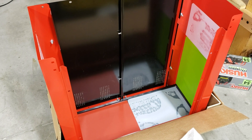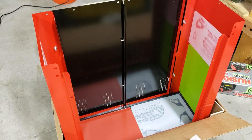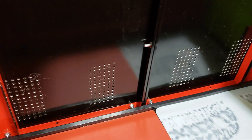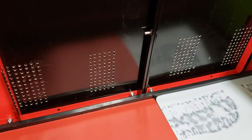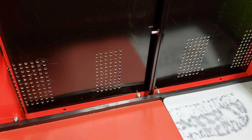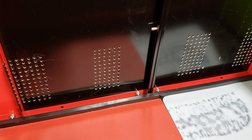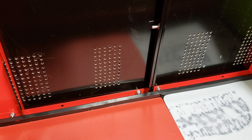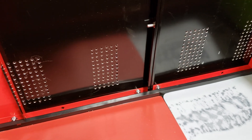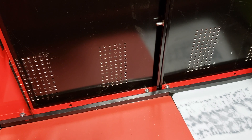Here's the inside of the power wall itself — the same Craftsman enclosure, since I'm using the same batteries. I've done a couple of changes: I've made four distinct ventilation points so each line of batteries will have its own ventilation point going from the bottom to the top, and the fan on top of the power wall will draw fresh air through them. That was a lot of work to get those holes semi-straight — there are actually 288 holes.